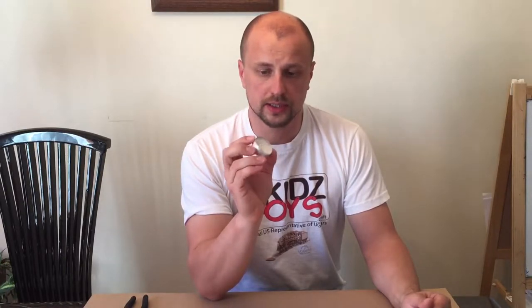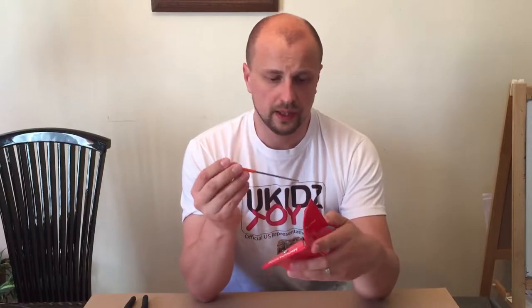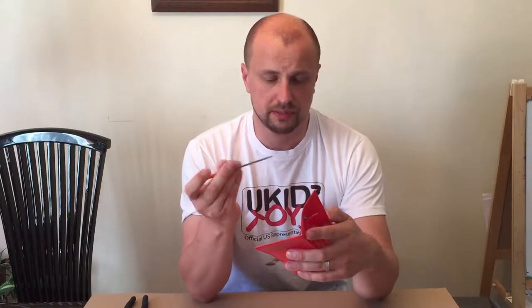Speaking of lubrication, I do have a tea candle here. I'm using it to lubricate the parts, specifically gears, because some of the operation will need to be a little bit smoother. The tea candle is recommended because it's wax rather than oil, so it doesn't get absorbed too much into the plywood, and it helps the operation a little bit. Another tool that I'm using is a little file. The file helps when you break off the gears or some kind of parts and there is some plywood or imperfections left on there, so you can remove it by filing it off.